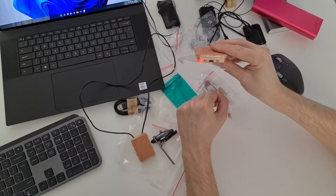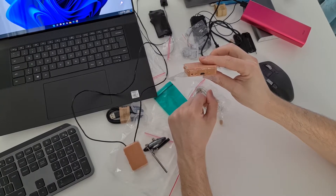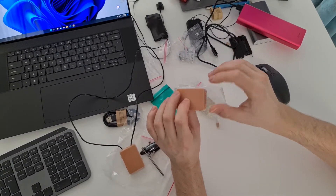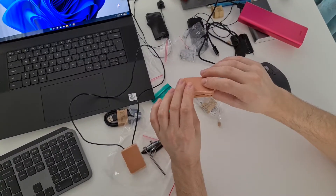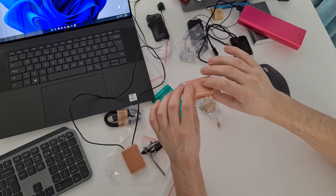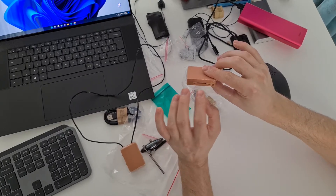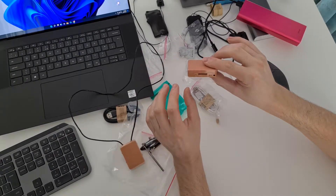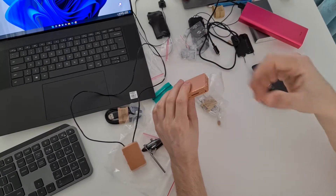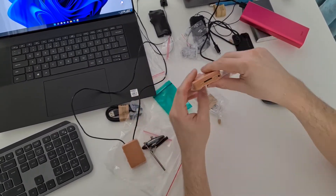After pressing the reset button, press the on/off button and keep pressing for two seconds until a red light turns on. After the red light is on, you can release the button. It is very important to do this step because you cannot tell when the GSM box is on or off — it is designed to show no light when working. First press the SOS reset button to make sure the device is off, then press the power button to turn it on.